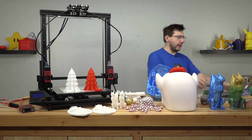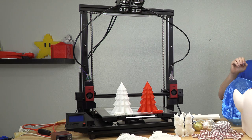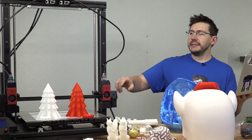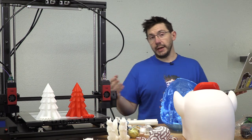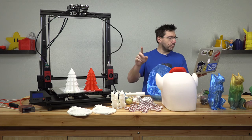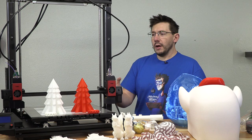Specs on the machine — I brought up my laptop because I was having a problem remembering things. The T-Rex 2 Plus is a large format multifunctional 3D printer. It has a build area of 400 on the X, 400 on the Y, and 500 millimeters on the Z. It's got independent dual extruders, industrial linear guides on either side of the gantry columns, TBI ball screws, quick replaceable hot ends, UBL auto bed leveling, an extruder wiping system, a customized print bed, dual zone heating plates, high temperature extruders, and a laser engraver — with the last few being optional.